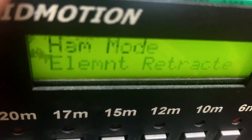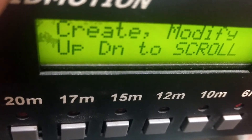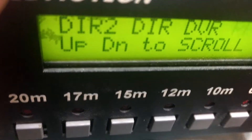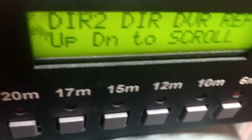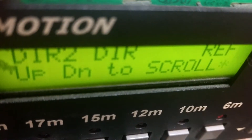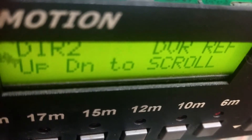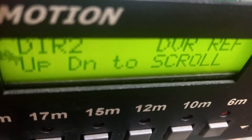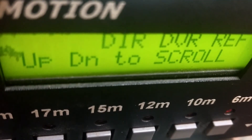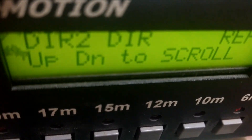We're gonna go try it out, see what happens. Just gonna do open frame here. Got power. So we're gonna go to setup mode, look for test mode. There's the reflector. Let's go to the driver. Bang, back in business. And since we're here, we'll do the director. Test it one more time. Yeah, sounds good and strong. Alright, so replace the driver chip, we're good to go. Let's go.